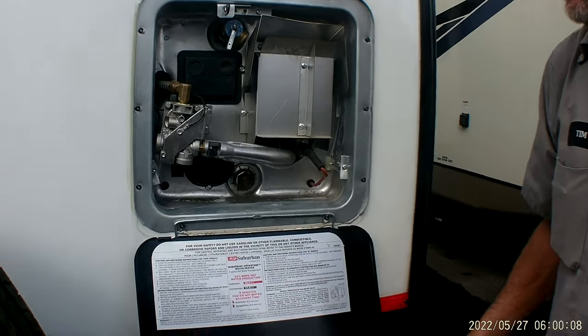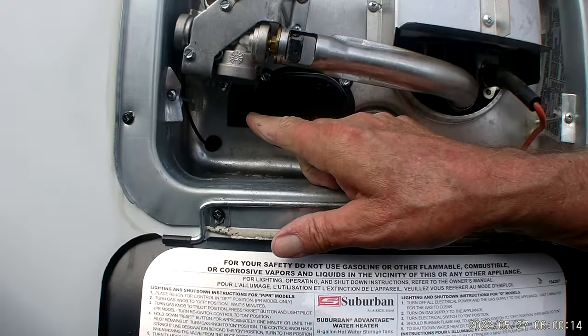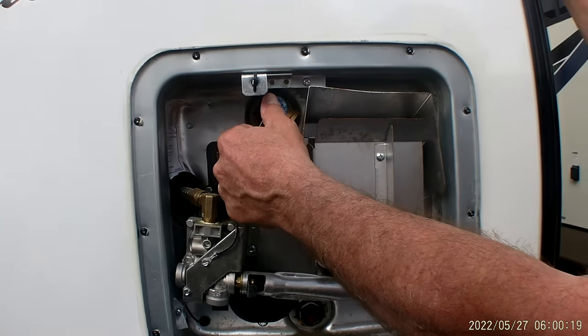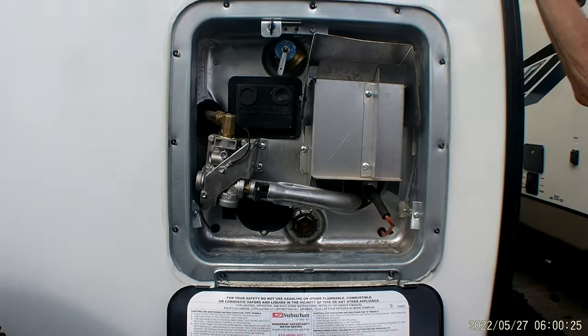Outside of the hot water heater connection is next. The electric switch is in the lower left-hand corner on the outside. Your gas switch is going to be on the monitor panel on the inside. Before you turn either source of heat on, you want to make sure that you have water coming out of the pop-off valve before you turn on electric or gas.